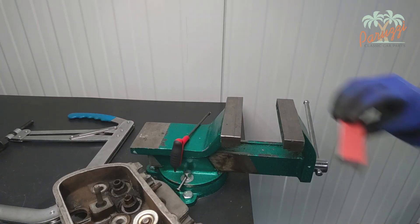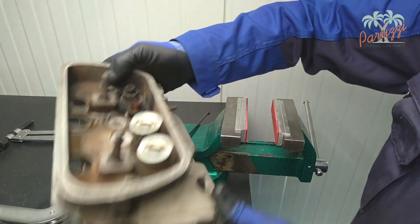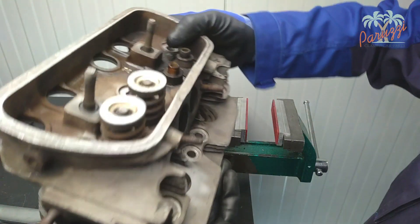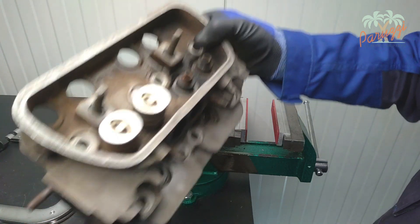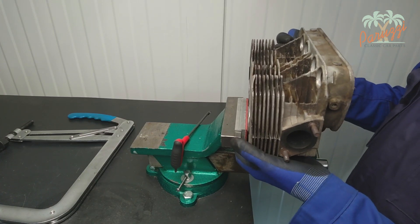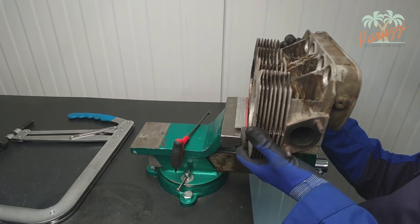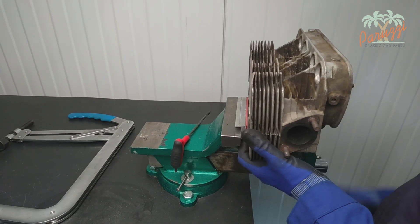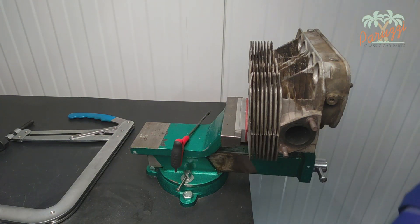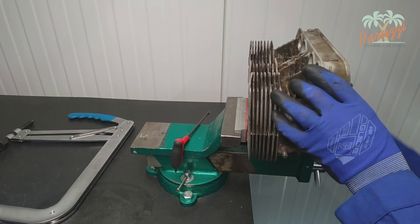For this you will have to use vice jaws so as not to damage the soft material of the cylinder head. As just said, experience is required. The cylinder head is strong in that place, but tightening the vice too much, or tightening the cylinder head in the wrong place, could damage the cylinder head. And if the cylinder head is not tightened properly, it could come loose while you are applying great forces — bad for the cylinder head, but also dangerous for yourself. Above all, take your time to tighten the cylinder head properly; it will save you a lot of work afterwards. Tighten the vice firmly, but not too firmly either.